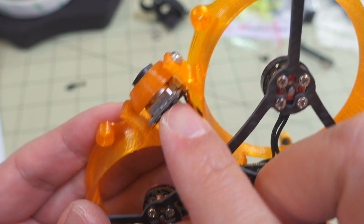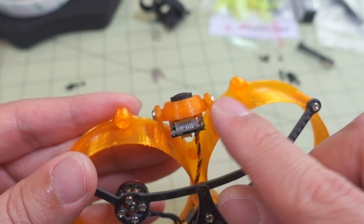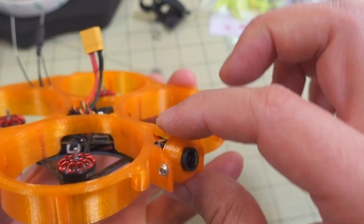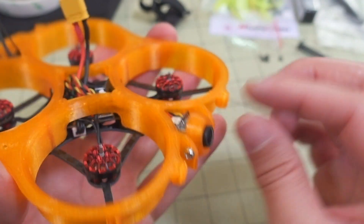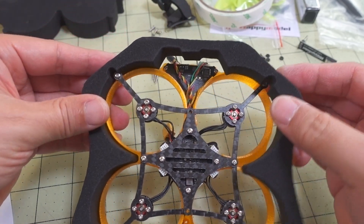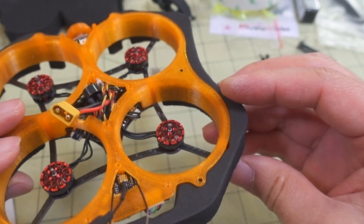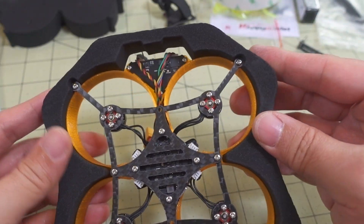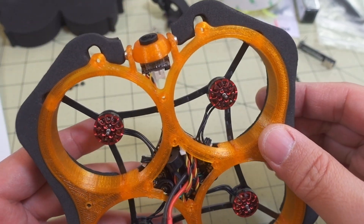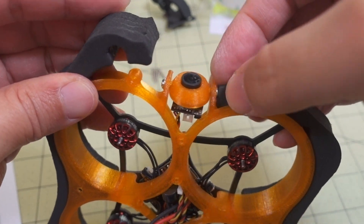The camera mounts into a little TPU piece with screws included in that bag. The camera holes on the side of the frame are not used in this design — the mounting screw doesn't fit this camera as it's much wider. So you have to use the specific TPU mounting method. The camera is a little loose in there, so you need to make sure it's pressed all the way forward. Then you put the foam bumper pieces on the ducts, using double-sided foam tape to hold them on and give a bit more rigidity.